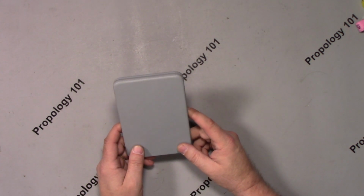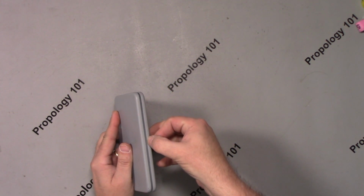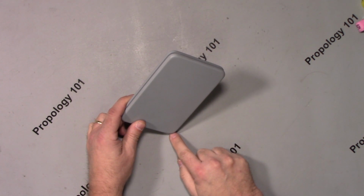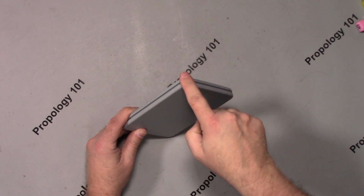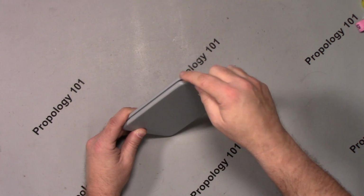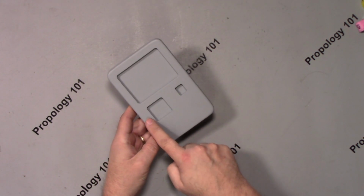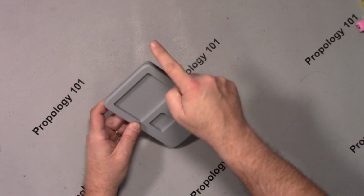Then later on, as time went on, we decided we were going to make a 2-piece mold, which split right along one of these edges. But instead of trying to pour this vertically like this, and try and pour the resin down, we decided we were going to go to the corner. So when you poured this resin, the bleeder was here, and we would simply have an injector toward the back somewhere here. And as the resin would be injected in, it would slowly, what we call sweeping up the edges. So there are no undercuts. If you're looking at that, there are no undercuts if it's at an angle, because that is going to allow the air in every direction to go up to the bleeder top.